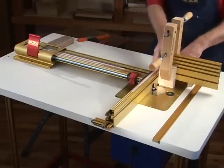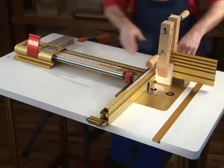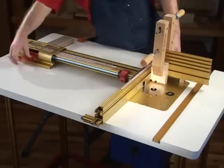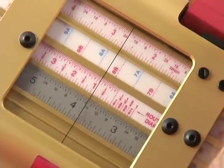Once you've reached the first mark, 5A in this example, and made the cut, simply move the LS positioner from A cut to A cut until you've cut across the full width of the material. Keep in mind that your first tail cut will be based on the width of stock you have centered on. It probably won't be 5A, and it may in fact be a B cut.